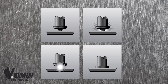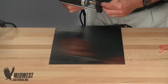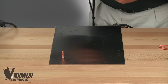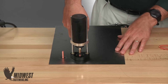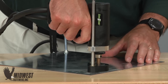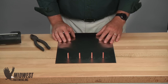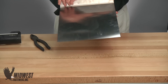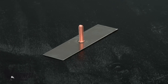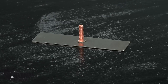This is the contact capacitor discharge stud welding process, as provided by all Midwest Fasteners CD portable systems. A closer look at the finished CD weld shows the advantages of capacitor discharge stud welding. Since easy hookup and maximum portability allow you to use it anywhere, we only need 110 volts of readily available electricity. The equipment produces low levels of heat or arc for the actual welding process, and the finished weld shows no backside burning or distortion. This provides many advantages, including a clean finish and clean appearance for an added benefit in many applications. The weld bond is created in a short cycle, plus exhibits good strength in the actual stud weld.